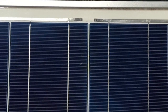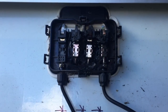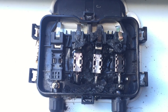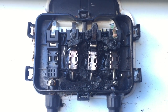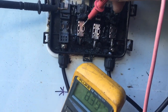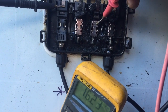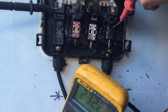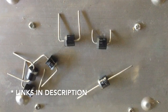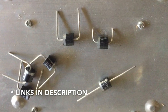I'm going to clean these up and we'll come back. There we go, I've cleaned it up. I also used a brass wire wheel on my drill to clean up the blackened metal. Now, the purpose of these diodes is if one of your panels is shaded or partially shaded in a string, the diode will bypass the current rather than damage the panel. These are 10 amp Schottky diodes — you can find them on eBay listed as solar panel bypass diodes.